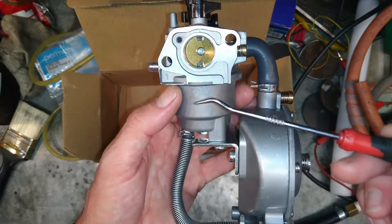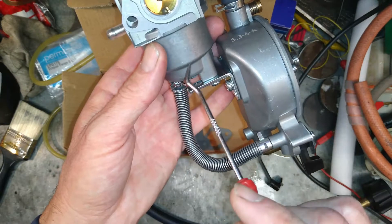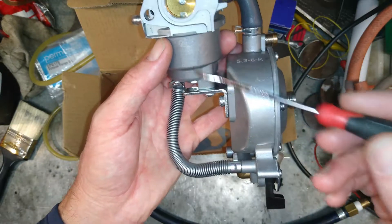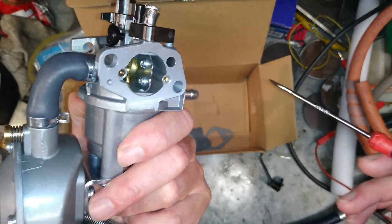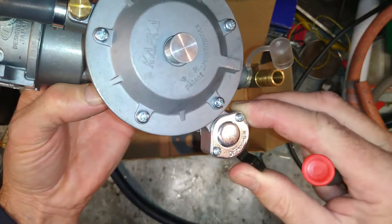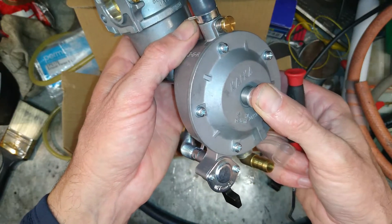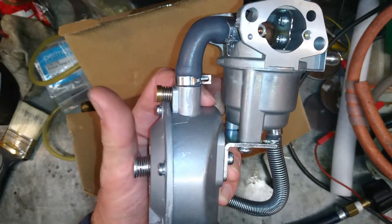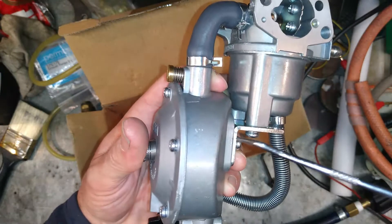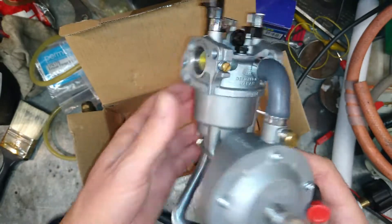Because you can run dual fuel — either petrol or LPG — there's this hose down here which is a drain for the carburetor. So when you go to change from petrol to LPG, stop the generator, turn the petrol off on the generator tank, and drain the fuel out. Turn that on and it will drain the float chamber of any fuel. Then turn on your LPG and push this button which primes a little bit of gas — it pushes the diaphragm down in here which allows gas to come through. Normally this diaphragm is pushed down by vacuum being pulled, which allows it to deliver. Give it a little push to prime the engine with a bit of LPG, pull the lever and away it should go.